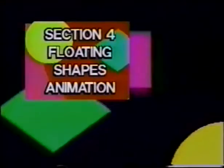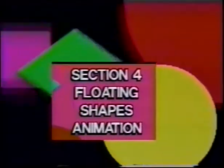What you're seeing now is a floating shapes animation. You can use this as a background or to dissolve it halfway into a background for a nice effect behind titles or a square wipe in the middle with a picture or whatever reason. You can make it yourself with the MX or AVE mixers by taking your mixer and setting a background color in one of the inputs. Then you want to disconnect the second input to give a black background.